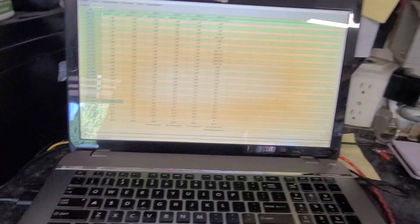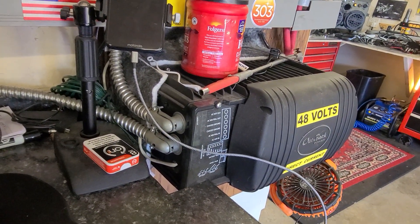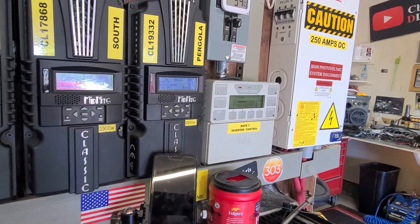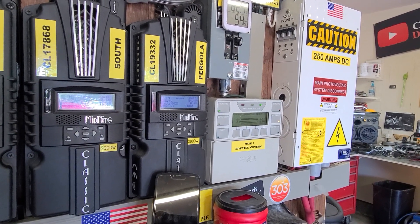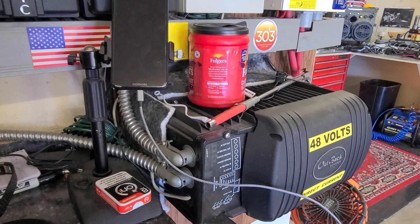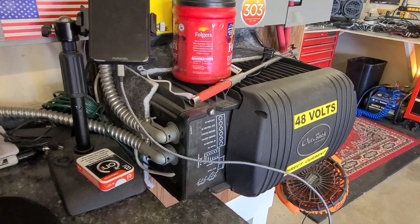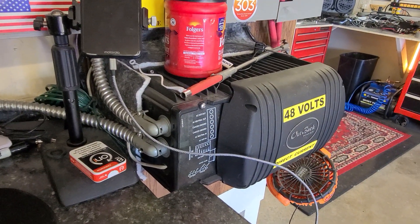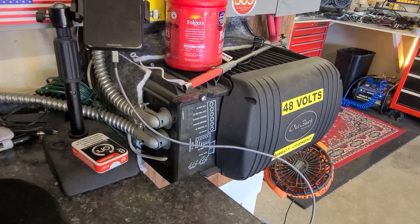No problems — I'm only inverting 3,500 watts off this Outback, which is great. I have 9,000 watts of solar panels coming into this system and I'm getting about 7,500 watts in, which charges up these 30 kilowatt-hours of batteries. Even at max power at 3,500 watts, that's roughly eight hours at full power. I could go bigger with a larger inverter, or even do 240V split-phase with two of these.